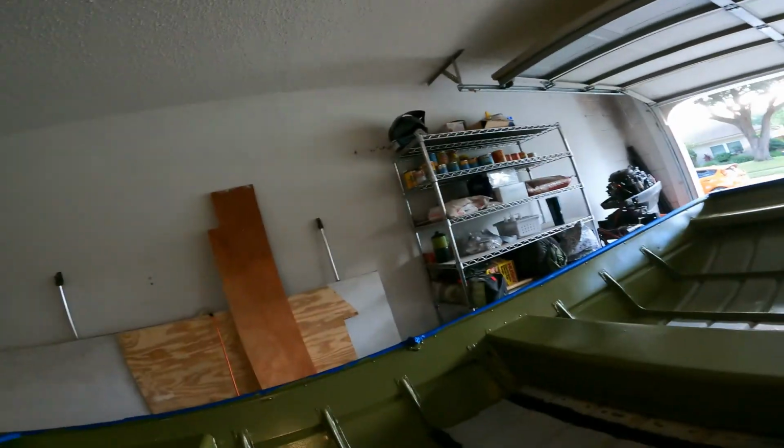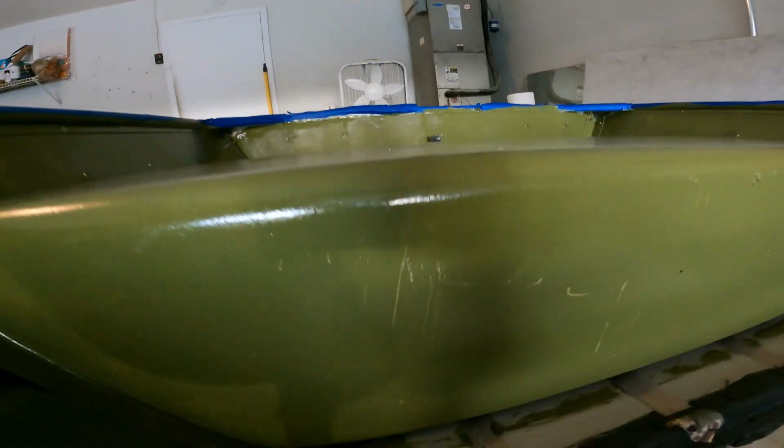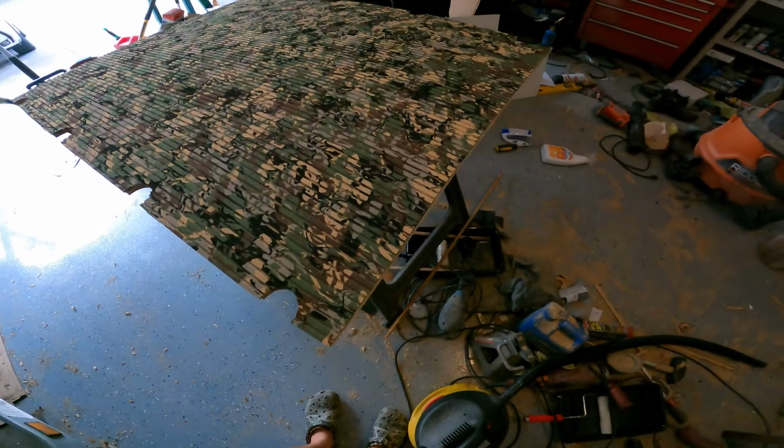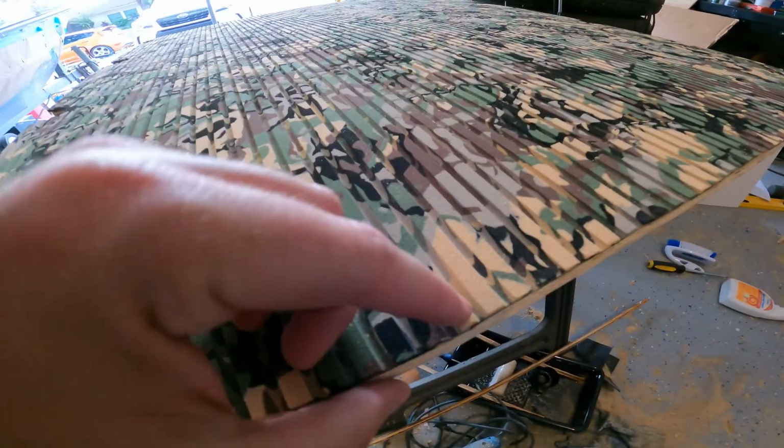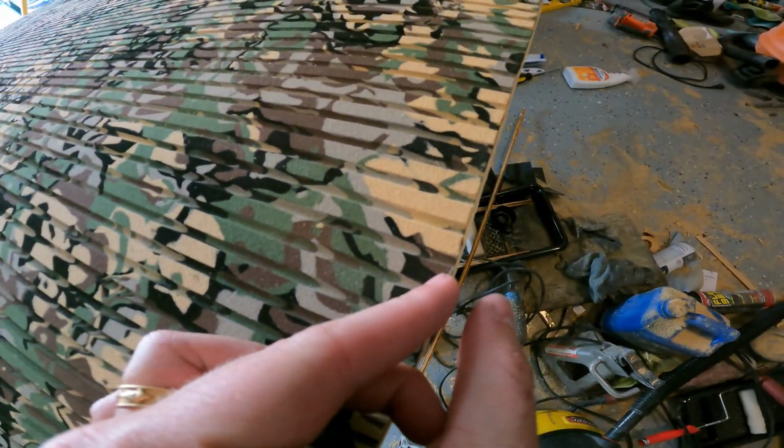All right, we got the HydroTurf down on the deck. Got it all cut out, looks good. There was a little sliver of plywood left showing, and that's okay because when I was test fitting that deck, I scraped up the benches on both sides because it just barely fit. It was a friction fit to get it between the benches. I didn't really want it like that because I want to be able to take it out without messing up the paint and everything. So after the HydroTurf was laid on, I came back with the circular saw and just ripped off that little tiny sliver.